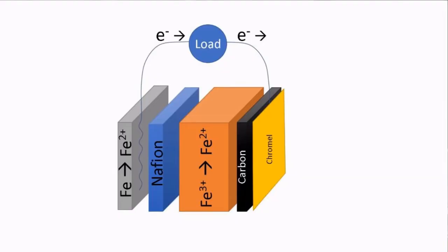For those of you who are new here, I have been making an all-iron battery for the last year. I have been exploring different chemistries, different cathodes, and different separators in an attempt to make a battery that has an iron anode and some form of iron — iron(III) salt of chloride, sulfate, EDTA — something that can accept electrons from the iron oxidation at the anode.